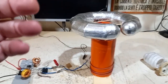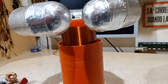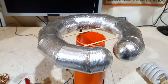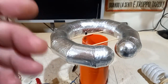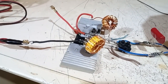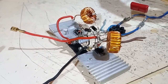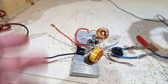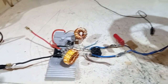This is my first attempt at a ZVS-driven SSTC Tesla coil. I'm using a secondary with a fairly low resonant frequency, with also a top-load to reduce the resonant frequency even more — but maybe a top-load in this type of coil is not appropriate because it makes the resonant frequency too selective, probably. As driver, I'm using this ZVS that I made some time ago, built with MOSFETs — small MOSFETs taken from computer UPSs — rated for 60 volts and high amps, like 65 amps. These are low-voltage, high-amperage devices.